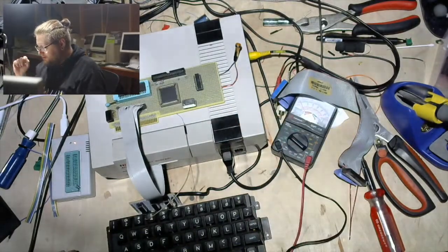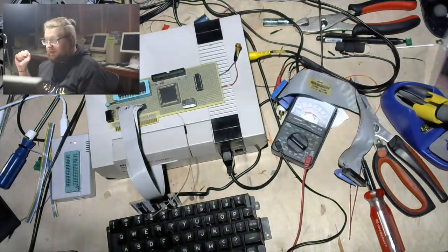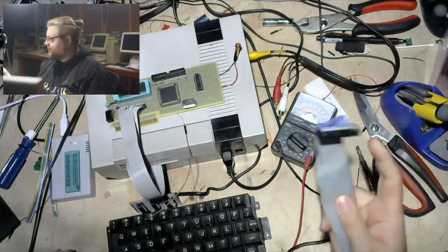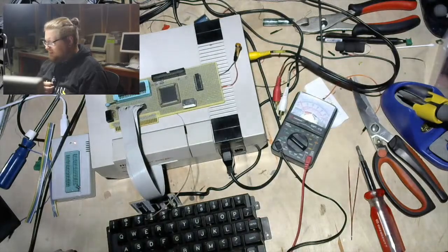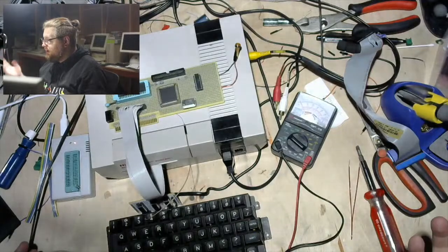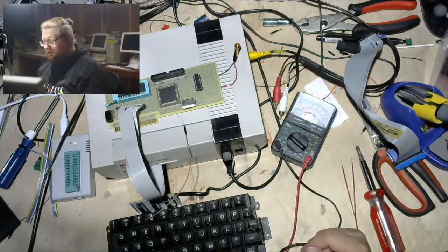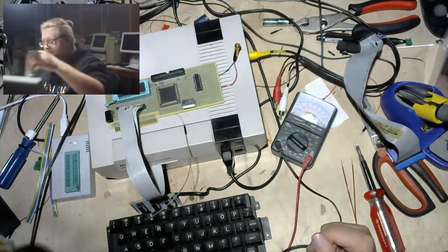So we'll get back to seeing if we can get this infuriating little thing working. And then finally, if we have time, theoretically, I have a floppy disk here. I grabbed a floppy cable. We could not find this last time, and I still couldn't find the one that I'm actually looking for, so I just stole this from another computer, and we will restore it when I find the other one. But maybe plug in the floppy drive, power it on, and see if we can turn on the drive motor for it, because there is actually a register for that in PS2 mode. I don't know how you do that in AT mode. It's a mystery to me. But that's that.